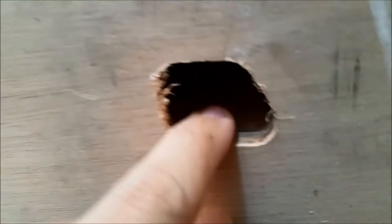I've done just a small sample. Feeling in there — you probably can't see it too well — but the bottom looks perfect, it's just barely cutting into the joint. On the top, I can feel I haven't quite made it because I'm bumping into some squeeze-out epoxy. So I'm going to continue widening out this hole and then I'll show you the finished product.